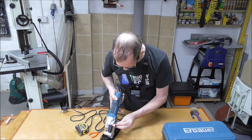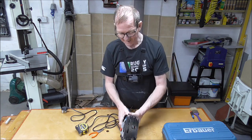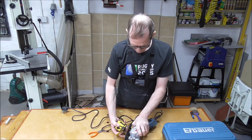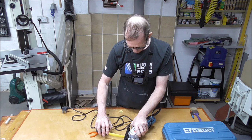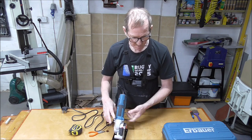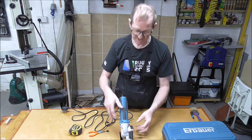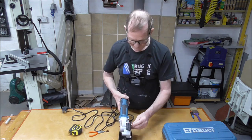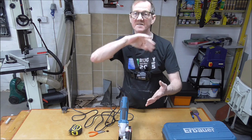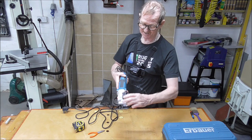So, I'm going to put it there to 18mm. What I'm believing now is 18mm. Whether the scale says it or not. And this is 18mm. Okay, so, right, we can work that scale by learning its imperfections. Once we learn its imperfections, we get used to it and we know, right, now we don't set it on the bottom of the line like you would expect normally. You set it on the bung nose at the tip. So that is the calibration of that is sorted.